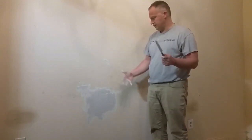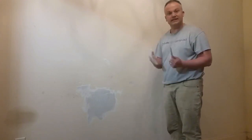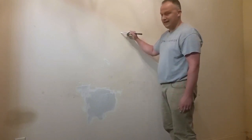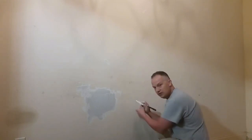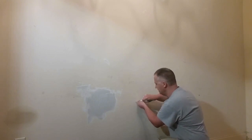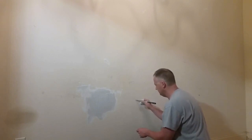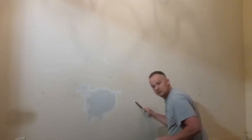After you've gone around and puttied up the holes, we're now going to get a sample of this color. We're going to use this sample to take to Sherwin-Williams and get an exact match. The way I like to do it — I have just a regular knife. Generally you don't want to do it at eye level, because that's where most people are going to be looking. So I'm going to go down here, and I'm not going to go all the way through the drywall — just cut off the very top surface. It's almost like a tape. I slowly work it out so I still have sheetrock in the wall. I just want to get that top color, and I'm going to take this to Sherwin-Williams and get a match.